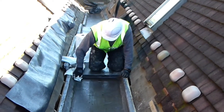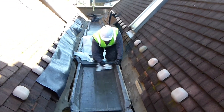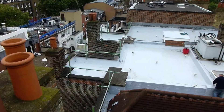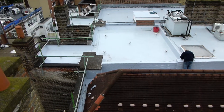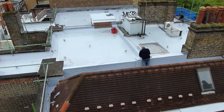Working as quickly as we can because of the weather, we strip all the tiles and the battens off either side of the existing valley. We're now going to build up a waterproofing system over the top of the lead work, then redress all the tiles back over the top, making sure we use a valley guard which is dressed under the felt and over into the valley to bridge that crucial part.